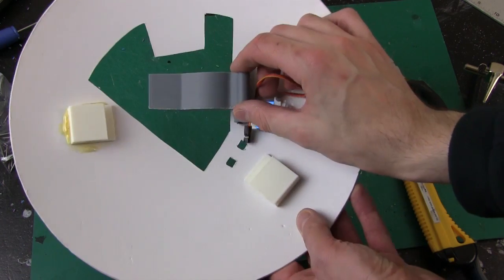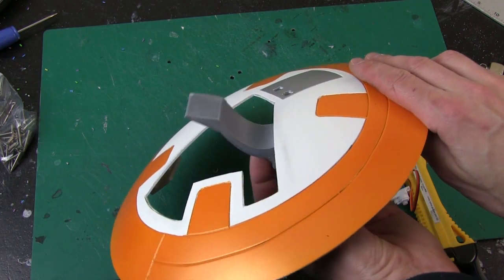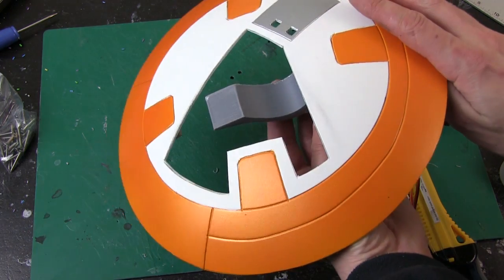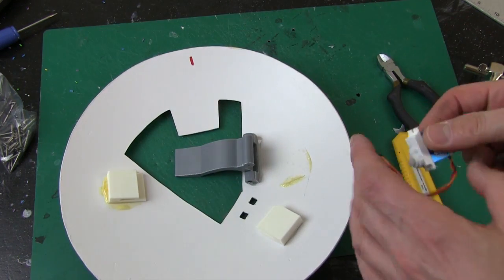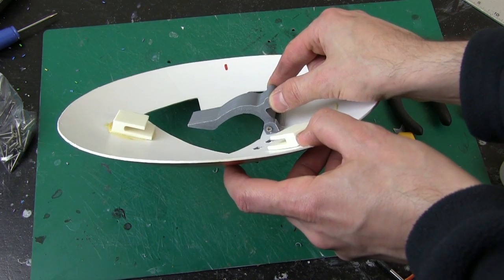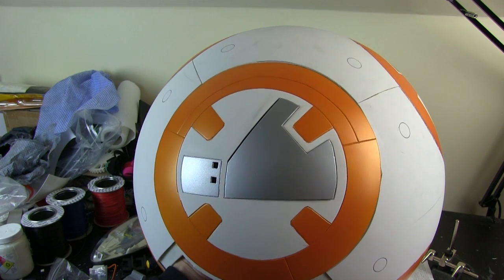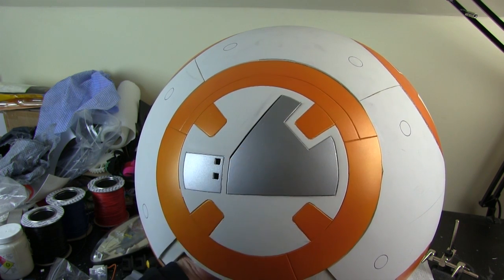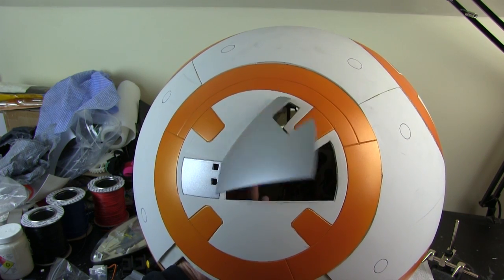Here's the arm fitted to the side — this will push outwards like this, and on the outside it lifts that panel well clear of the frame and all the way around so it can open right out. I'm just painting the panel on the inside at the moment so it's not white when it opens — it'll be silver all over. That just needs to be relocated in the hole and this piece stuck onto it. Then I just need to make a servo mounting to sit behind it with a rod that pushes on that top pivot point to push it out. I had to cut a bit of extra clearance on this edge just so there's enough for it to skim past the frame. That seems to work pretty well, so I'll get the other one sorted and put the servos in.